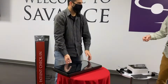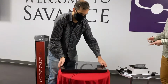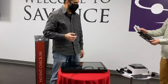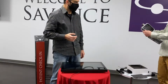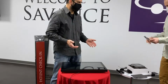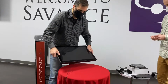So you'll have a baggie of 440 screws. And what you'll do with those is mount the gray flat plate that comes on the back of the temperature sensor to this device. And then once you've mounted that, that's where the temperature sensor can be attached and then further screwed in with some screws that come along with the temperature sensor. And we have a whole video that outlines that particular procedure that Dan has done. Dan will go ahead and do that, but we'll continue to talk about some of the other brackets and how those work.